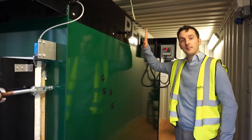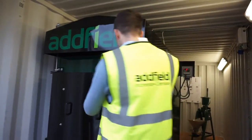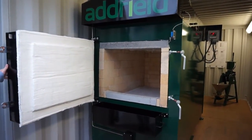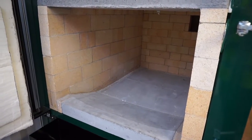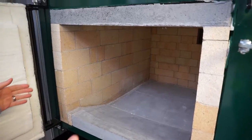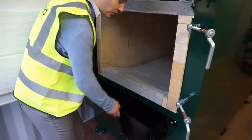I'm going to run through some of the features of this machine, and first we're going to start with the primary chamber. Opening up the primary chamber, you can see that we have a large enough volume there for anywhere from a small cat up to a Great Dane. The primary chamber is loaded usually with a roller trolley, and that pulls the ashes from the hearth directly into the ash box below.